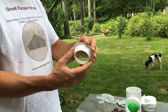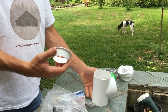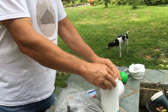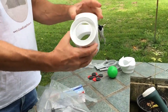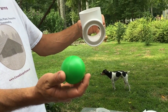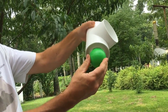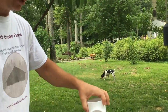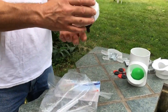Also, what goes in the T is the ball stop — I believe that's what it's called. I'll install this right now. So we have a T-connection, and this piece installs like this — it's a little bit tricky. There we go, it just sits in there like that. The theory is that as the three-inch PVC fills up with water, the ball floats up and seats neatly into this stop, and that's what holds the contaminants locked in the tube below.